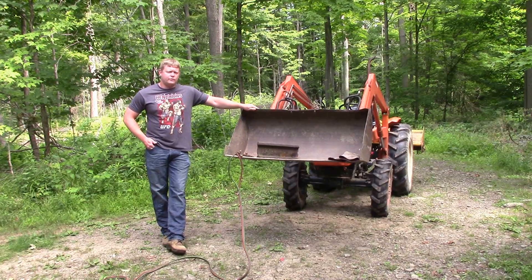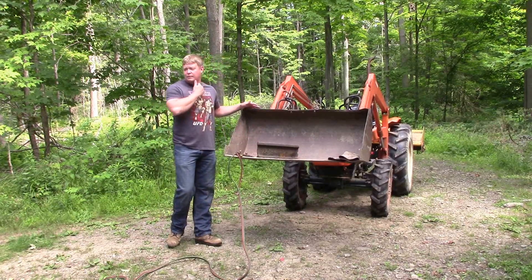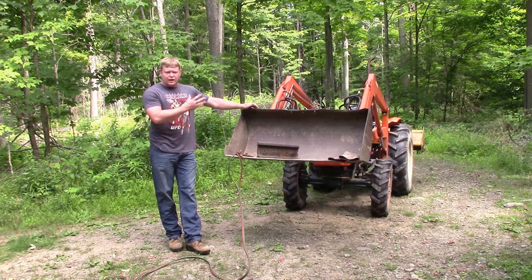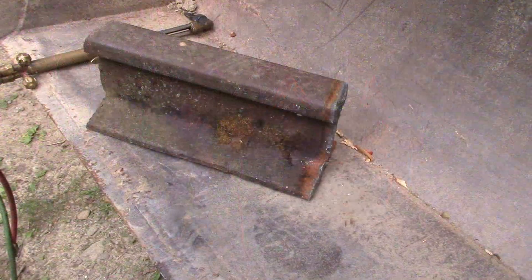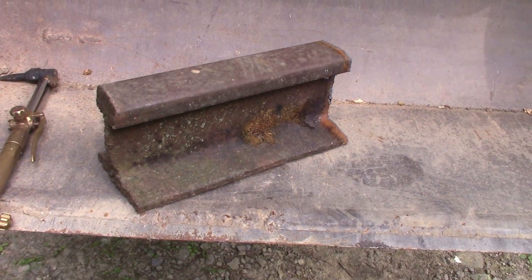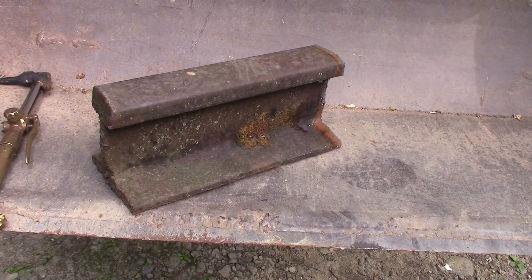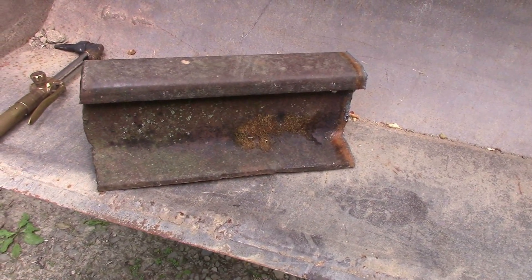This is our setup. We're about to start our anvil project. I took the piece of railroad track and threw it in the bucket of a tractor. I've got my torches over here. Keep the hoses out from the drop zone of all the hot stuff. The bucket should contain all the slag and dross and metal that we're cutting off. We'll take a look at the anvil for a before shot, then get into marking up our cuts. You can be fairly artistic with this project — there's no limitations as far as dimensions go. It's kind of a creative project.